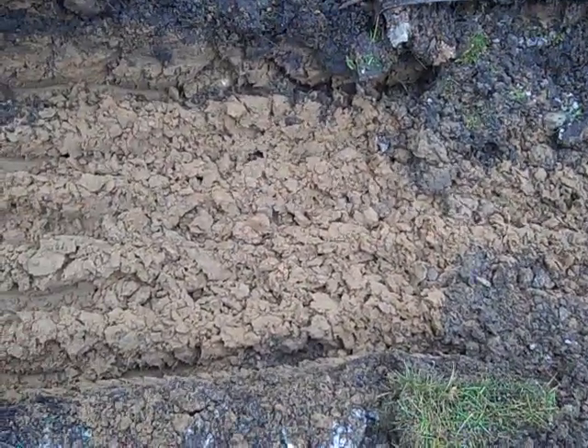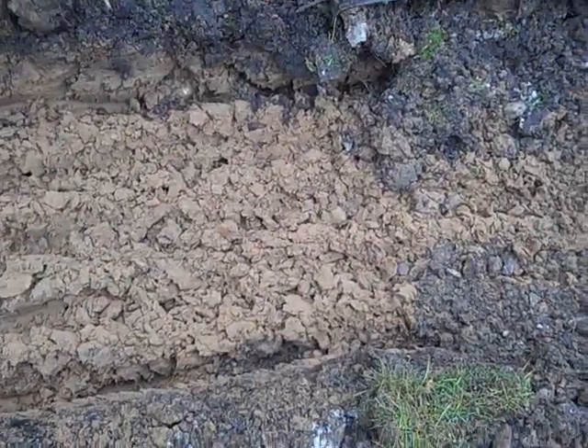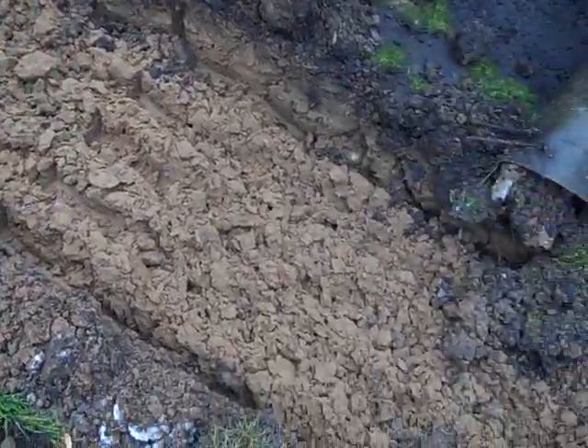So we know not to dig any deeper than six to eight inches, and then we get hand digging going on over here. We've hit the most important part of the job, which is to make sure we don't pull out any utilities, and then we can continue on with the job cautiously all the way.